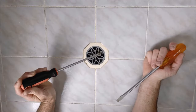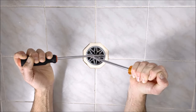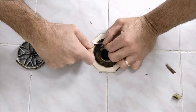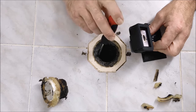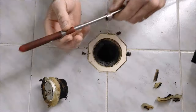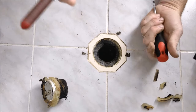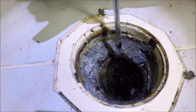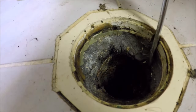Some drains have a screw that can be removed, some are a friction fit, and some are glued in place. It seems to be stuck in pretty tight — turns out it was sealed to the drain base with silicone. This drain looks like it's been made of two separate parts and all bunged together with a whole lot of silicone, which has essentially blocked off the waterproofing membrane from delivering water to the waste pipe. The membrane is no longer intact around the drain, so any water getting through gaps in the grout just runs down the outside of the waste pipe and drips onto the plasterboard below.